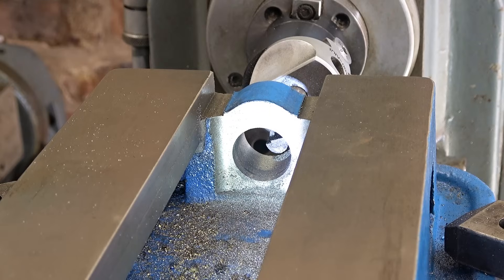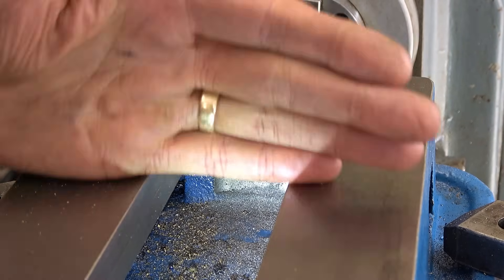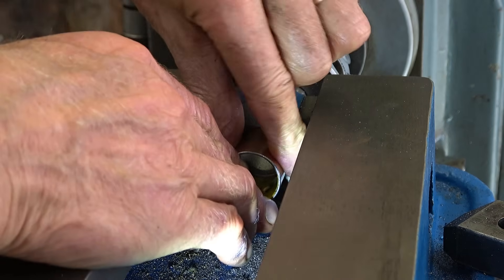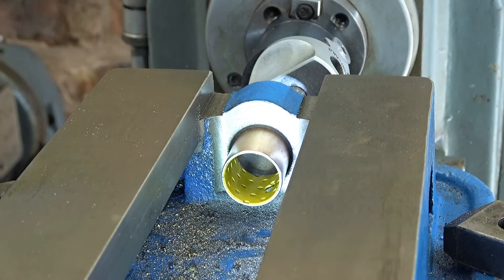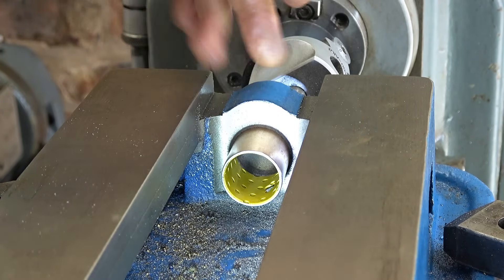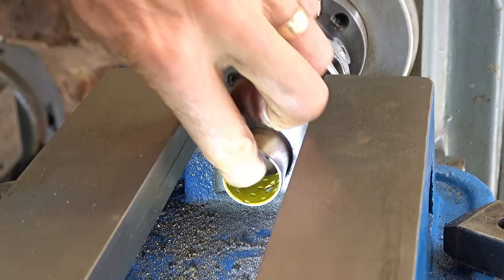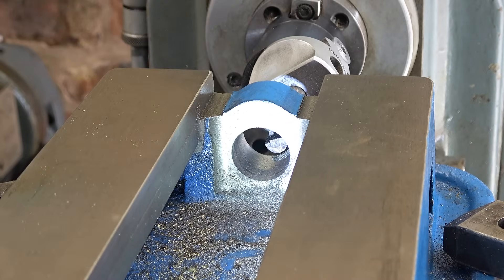As I'm getting really close to size, I'm actually machining from this end and drawing it towards us, so I can test fit the bush. It's just going in. So I've got a couple of options now — I could tap that in if it was machined right through, I could tap it in and Loctite it. Or I could reduce my cut very slightly and that would allow me to make it a slightly tighter fit.